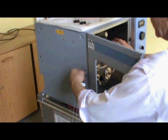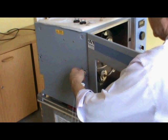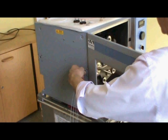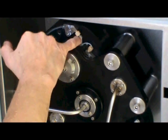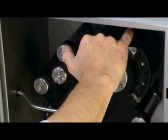Once you finish the first bobbin, grab all four flying leads as shown and then rotate the rotor clockwise two or three times in order to spin up the leads and to take out any slack. Before attaching the flying lead clamp to finish the process on the first bobbin, make sure that there is enough slack between the nut and the bobbin itself. You can do this by inserting a finger underneath as shown. You don't want them to be too tight but at the same time you don't want them to be too slack either.